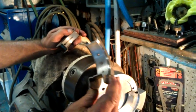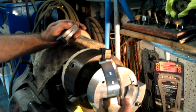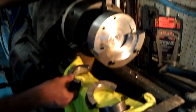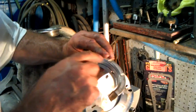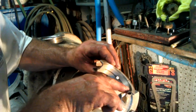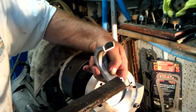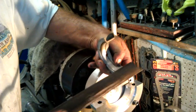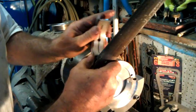However, this has no groove either. Our idea is to go ahead and put oil on the thrust surfaces of this bearing, and what we're going to do may look a little brutal, but the only way we can get oil to this surface right here is by bleed-by on the edge of the bearing, or what we do is this: we cut a flat groove in it with a file all the way across it, and this allows oil to go ahead and run in two directions. We do it on both sides of the bearing.